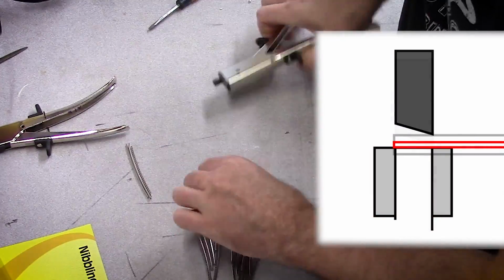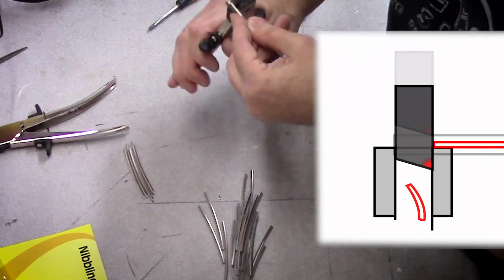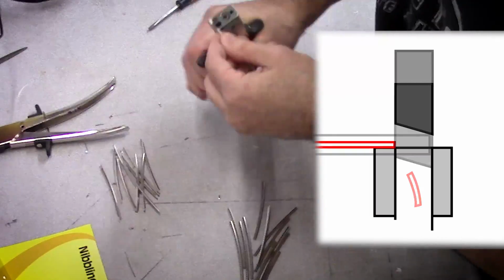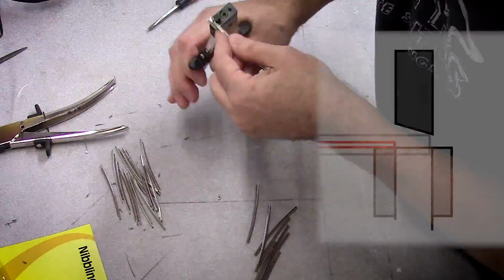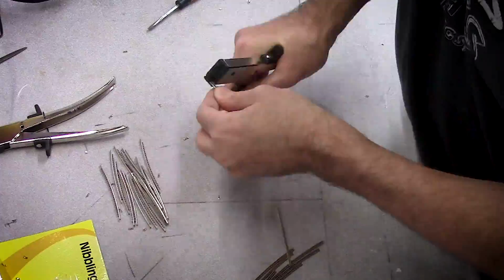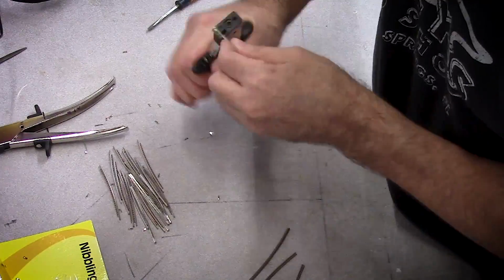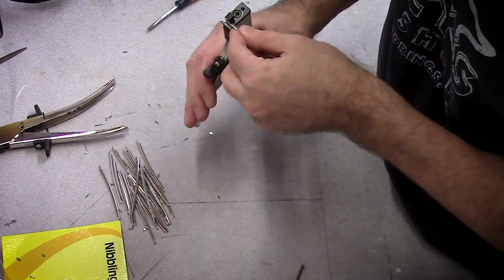I realized I typically feed the fretwire in so the tip of the cutting head has to pierce through the tang and then shear the rest of the tang off. I then started wondering if I should feed the fretwire so the tip of the cutting head doesn't have to pierce the tang but rather just shear. I need to do a little more testing on this and see if it works. It's possible that I'll run into some other issue, but I need to start paying attention to how I perform these little tasks instead of just being a robot and chopping fret wire to pieces.